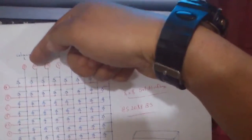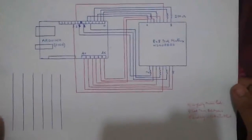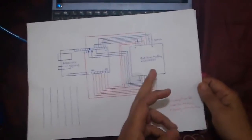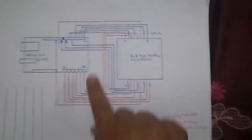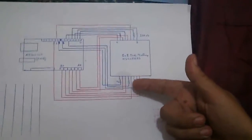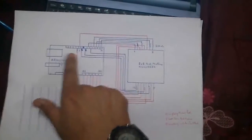Then I plugged the following circuit, which was very easy to build. I just didn't want to use any other integrated circuits like shift registers or Darlington arrays. I plugged the dot matrix directly with an Arduino as shown in the schematic — rows are drawn in blue lines coming into Arduino digital pins 0 to 7, and column lines are drawn in red coming into Arduino analog pins A0 to A5, then 8 and 9.